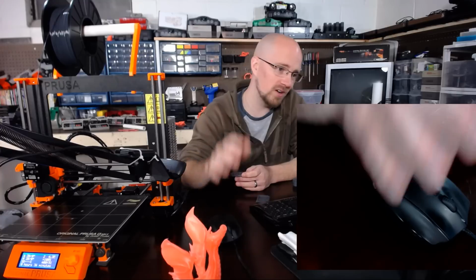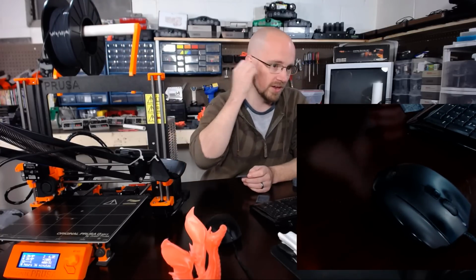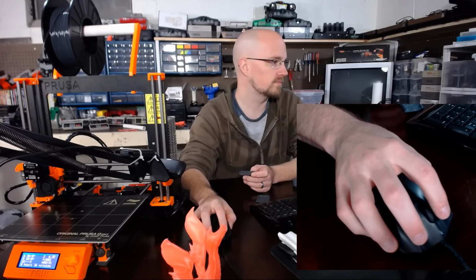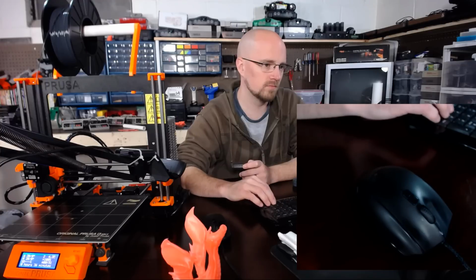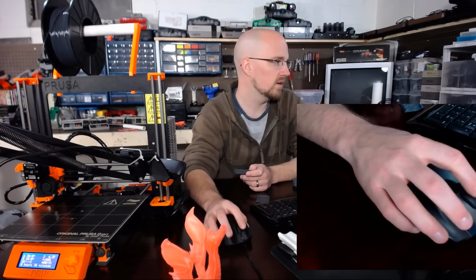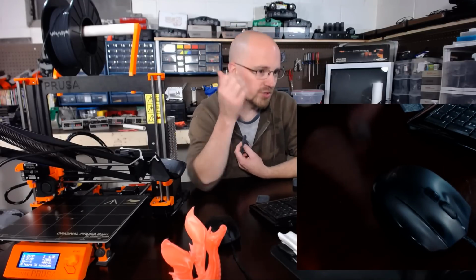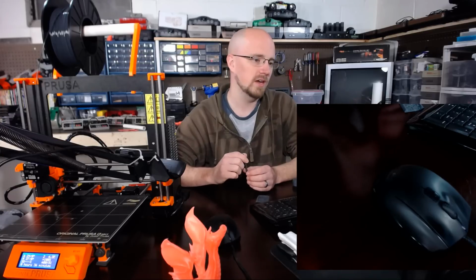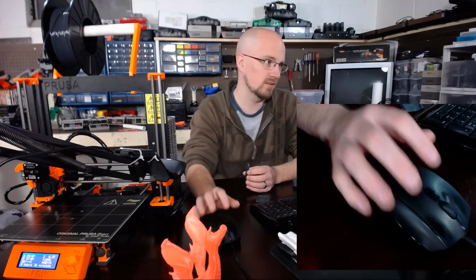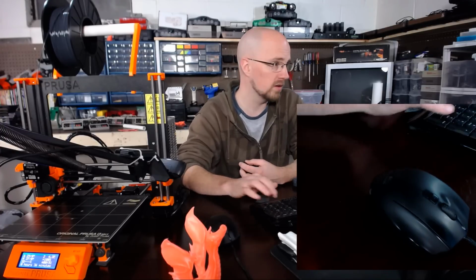It could be moisture. Like I said, I had intended on not printing for several days in a row, and then I ended up doing that with this, so that could be the source of that. Let's try 20% on this. And then, well, I'm at 220, and Peter's suggesting 205. Do you want me to try 210? We can do a test print at 210. Because like I said, I seem to have been having problems with that before.